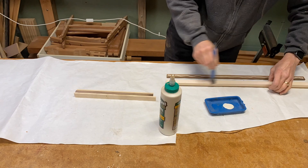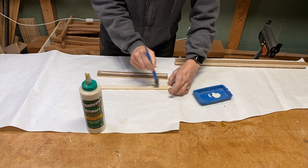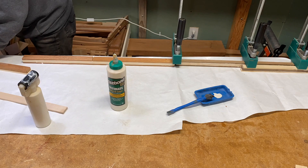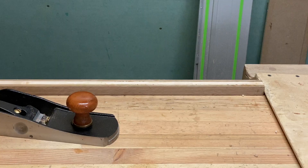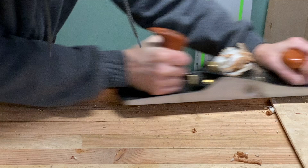Making this pinwheel pattern is a rather tedious process, but the end result is really quite impressive. Using a brush or a roller speeds up the process of doing the glue-up. By cutting sections to the same length and cutting out the flaws, I can ensure all of my parts will be solid when they're glued together. I clamp the work together as I go to keep good pressure between the layers. The heavy blocks on top of the layer sandwich ensure good pressure without using a lot of clamps. After the glue has dried, I plane the sandwiches even on their faces using a long bevel-up jack plane, which gives me a good flat surface for the entire length of the piece. Occasionally a card scraper can help address difficult grain areas.